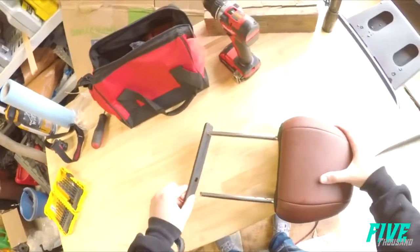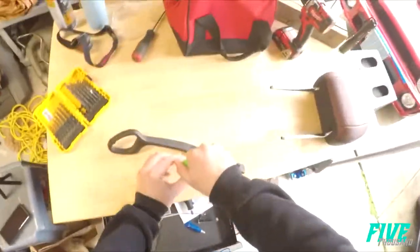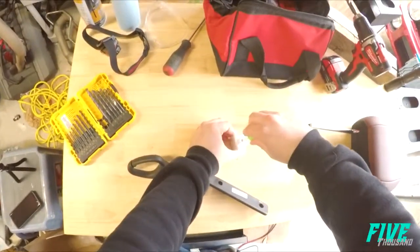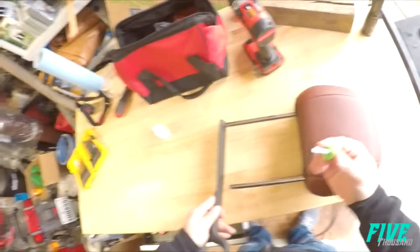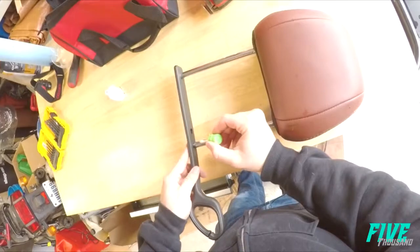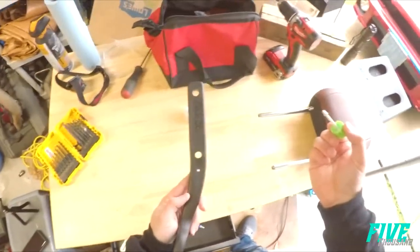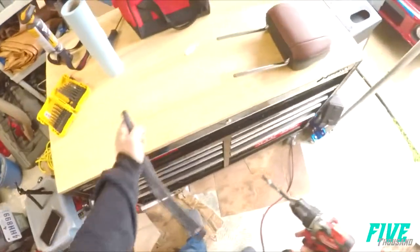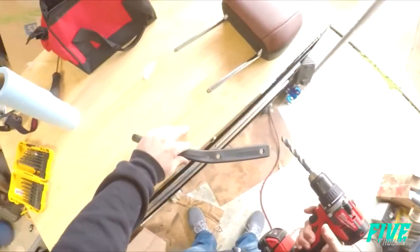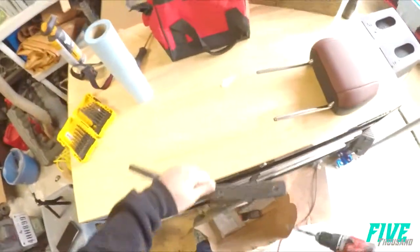After that one's drilled out, get a good measurement of where the next hole is going to need to be. I'll use a white-out marker — just a dab, since it's going to be drilled out anyway. It's an approximate; you know it's going to be in the center. So right there is exactly where I need to drill. I should also mention this does make a mess when you're drilling into this piece, so have something under it to catch it, or just let it fall on the ground.